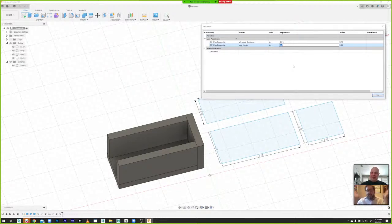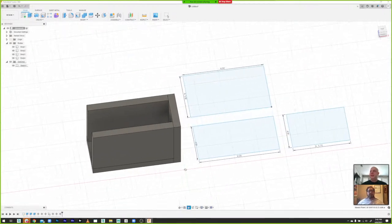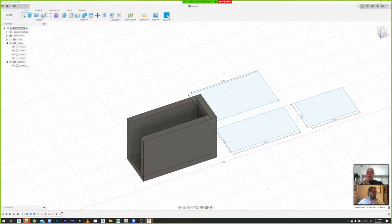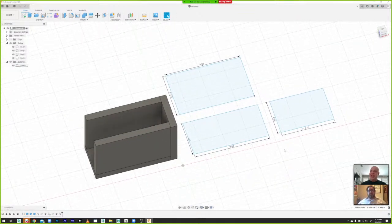If you had a super complicated design, or you were designing something for a customer and they wanted shelves to be wider, you don't have to go in and click all those sketches individually — it's already set up for you. You can basically say 'I'm going to make a version that's five inches tall,' change your parameter to five, and mill it. Then change it to three inches and you're ready. You can get really complex with these, and sometimes if you put in bad values everything explodes — but I definitely urge you to jump into the parameters, because it'll save you so much time and it's a lot of fun.